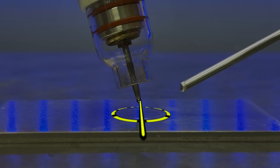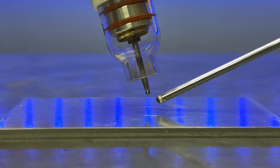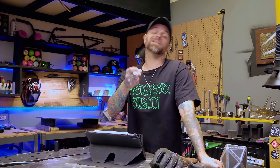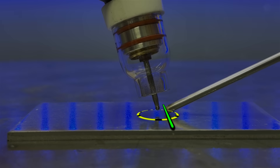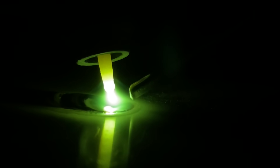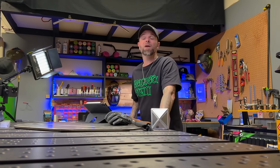Make sure that you feed to the proper area of the puddle — very important. Do not feed to the center of the puddle. This is going to cause you to pull your torch back a bit, increasing your standoff distance and arc length, or dip your filler material right into the tungsten. If you feed too closely to the leading edge of the puddle, the filler material is going to break off really clumsily and leave a mess — real ugly. Feed right in between those two points. The sweet spot is halfway from the leading edge of the puddle to the center of the puddle. Hitting that sweet spot combined with proper filler angles and practicing your feeding motion should seriously upgrade the efficiency and comfort of your filler material hand much faster.